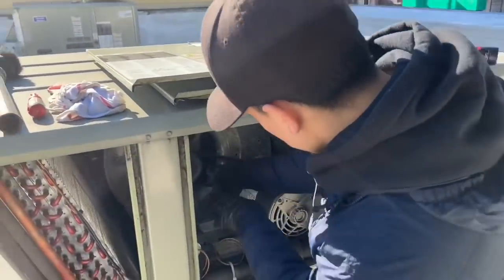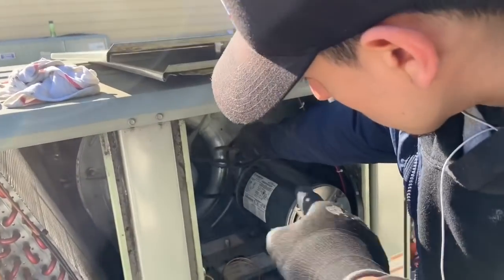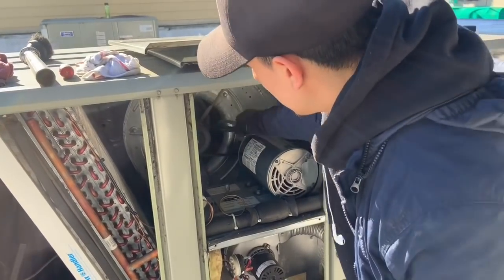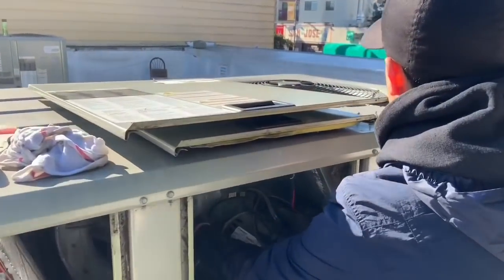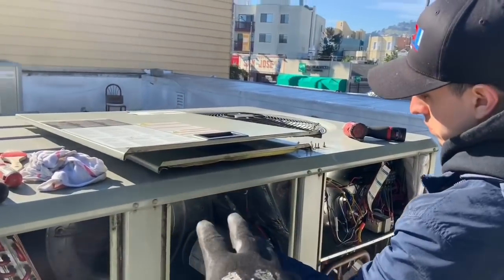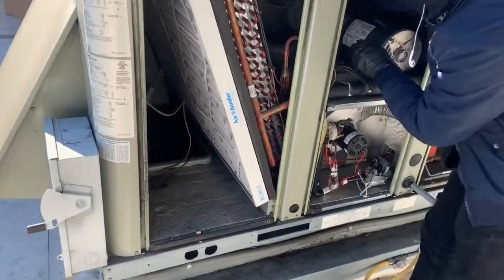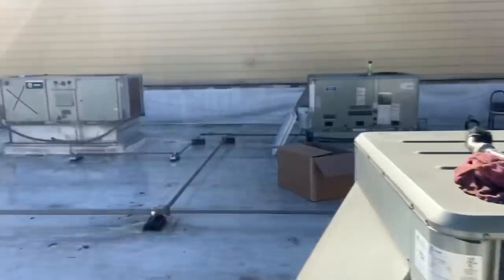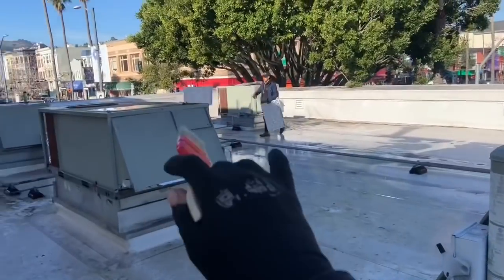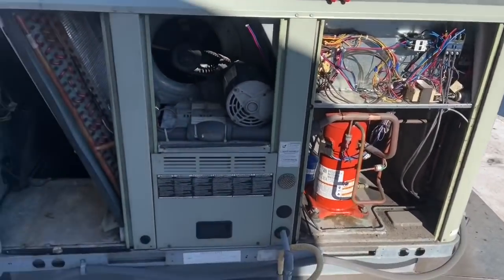Put it through the middle, power is off — good. Go back and forth, back and forth, then push it out. Nice. A lot of people like to cut the belts so they come off easy, but I don't like to do that because I like to save them as a spare. Everything's looking clean. Now that I'm done here with this unit, I'm going to start helping out — changing the filters, taking belts off, cleaning everything, taking amperage, all the good stuff.